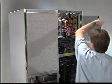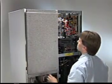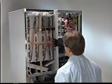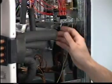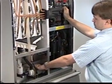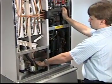If there is no water coming in, check the bin control. The bin control contacts supply power to all the other controls in the unit. To check the bin control, flip the unit switch to the wash position. If the pump starts, it indicates that the bin control is closed.